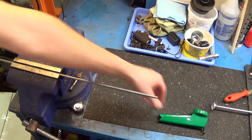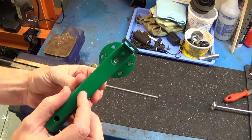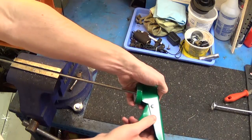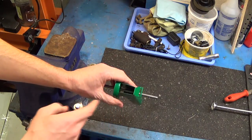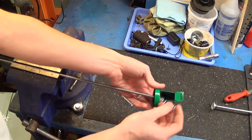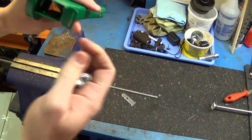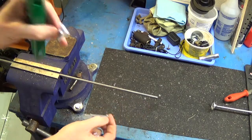Now that it's tight, you can see that the hole in the end and the hole in the side line up. Just for a test fit, slide it in and you'll see it slides through. There's one problem — we don't have the spring or the little plate in there yet. So take the spring and the plate — the larger ones — and pull the rod back out to the point where the spring can be inserted. The plate that goes on the inside is the shorter and thicker one of the two.